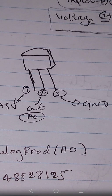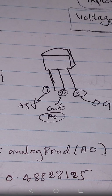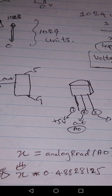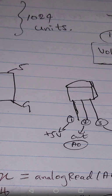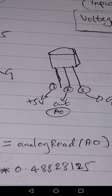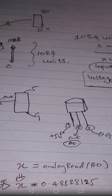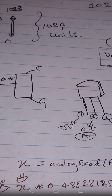Okay, so now you have the idea of the connection. If I give you the sensor, you can connect it now. Pin number 2 should go to the analog pin A0. So that is our concept. We know A0 is getting the input, so pin number 2 of the sensor is going to A0. According to Arduino, A0 is the input pin. So we will read the analog value here, as mentioned, and assign it to a variable called X, like how we assigned it earlier.